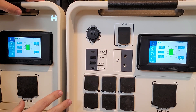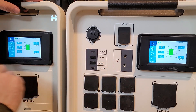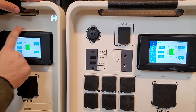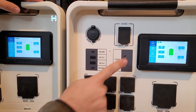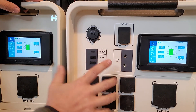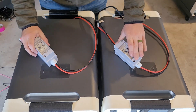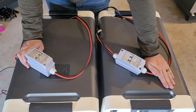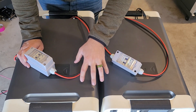I've been running this setup for over three months at my house with zero issues. This is the only system currently on the market that has load share and charge share. Any other system — if one unit has solar and the other doesn't, the other unit won't get a charge; and if one unit is running a load it won't draw extra battery from the other to balance out. The Apollo is the only one that does that. That said, it is still recommended to have solar input on each unit. On this unit I have 4,000 watts and on the other I have 2,400 watts — it doesn't matter that one has more, it takes the total collective and shares it between the two units.